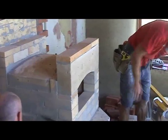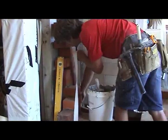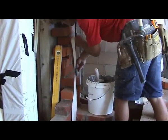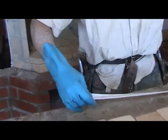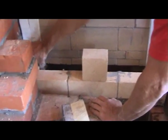The heater is constructed from the inside out, forming encased layers with different heat intensities. The separate layers are a necessary part of the heater's design to accommodate for thermal expansion. And thermal expansion joints are incorporated between the heater's layers, so that between layers there is no contact between brickwork.